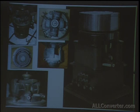Broadly, the instruments are divided into two classes, and this article has first a section of 8 instruments which have mechanical make and breaks or circuit controllers, and the second class has mercury interrupters. And it's basically a liquid form of make and break. The idea of mercury interrupters was used before, but mainly for induction coils and for special types of X-ray machines. They were pretty crude when compared to Tesla's. To the left, you see one of the few surviving models. This is not a Tesla-built item, but it was actually from Gaiffe Gallot, an X-ray company in France.